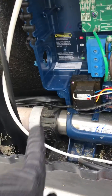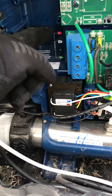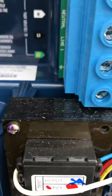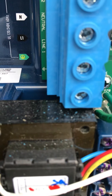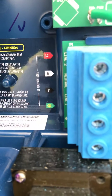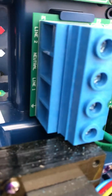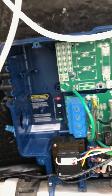The whip entrance point is on the left side of the box as usual. All our entrance points for the wires are right here, as you can see they're color-coded. The little green one signifies the ground — that insignia will always mean ground. Line one is the black, which is a hot. Neutral is the white wire. Then we have our other hot which is the red wire — that's line two. They just go into these little side ports right here and you tighten them down with the screw to ensure a proper connection. And that's how you wire up a Bullfrog spa.